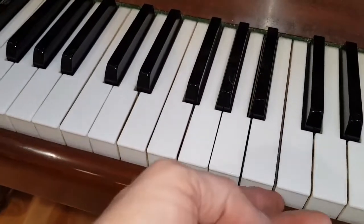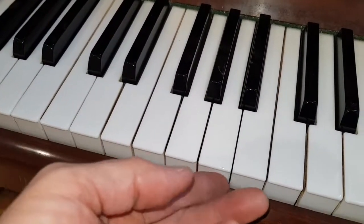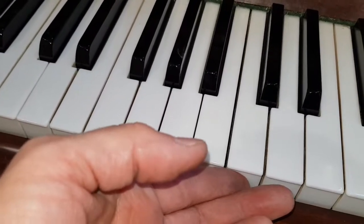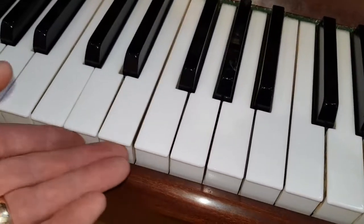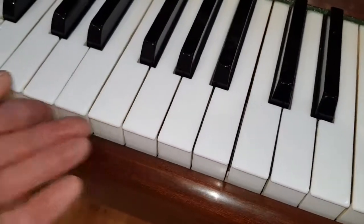Without looking inside the piano, you can tell by moving the keys from side to side that they've had a lot of wear — there's a lot of sideways play. There's a little what we call a cricket bat adjuster under there that you can use to take up that slack. I don't suppose the felt's worn through so much that it can't be done.